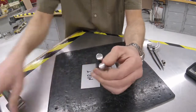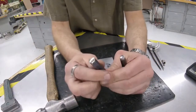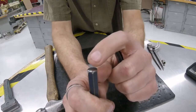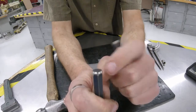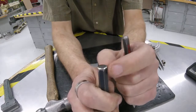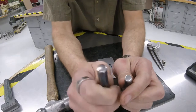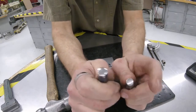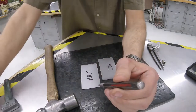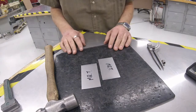Something to keep in mind when using punches: metal is a lot like play-doh — it mushes. You can see how the back has been mushed down and is starting to push out — this is called mushrooming. As it gets bigger it will start to crack and little pieces can fly off when we pound on it. If it starts to mushroom badly, bring it to me and I'll take it to the grinder and smooth the back end off.